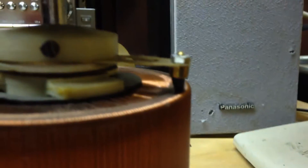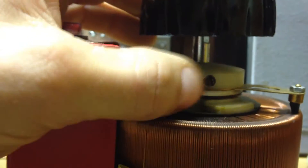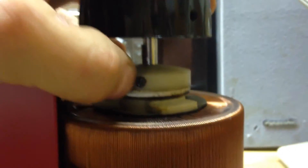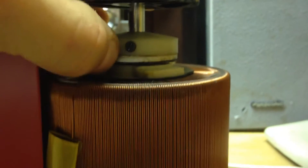The brush is in good shape, so what I did was — there's a spring right here that connects the mains through the coil. You can see these set screws. What I had to do was loosen those two set screws and push this cowling, or ferrule, down against that spring.